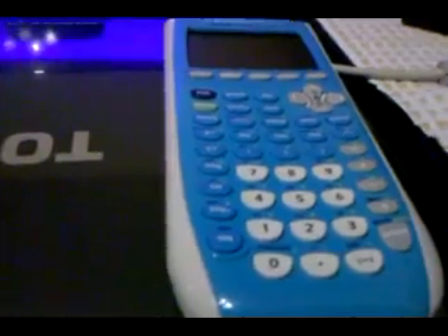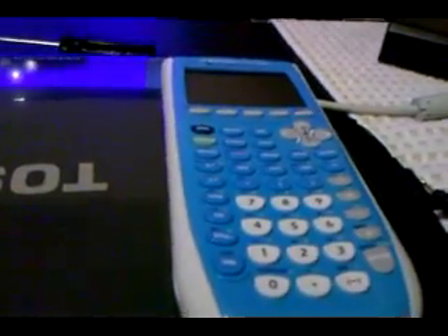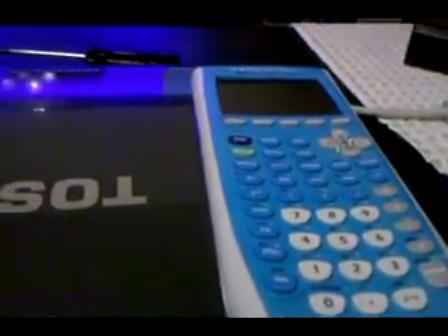Since I don't have a hardware USB protocol analyzer because it's so ridiculously expensive, in order to figure out how the presentation link adapter worked, I had to write an application on yet another calculator to pretend to be the presentation link, so that when I connected it directly to this calculator, this calculator would believe it was talking to the presentation link, it would enable its extra hardware, and it would send its contents to this calculator where I was able to log it and see what was going on. And then I proceeded to stare at the logs for a very long time until I started seeing the pattern, which took quite some time — it took all night, actually — but eventually got it working, as you saw.